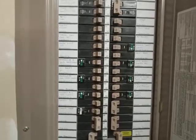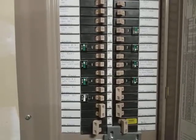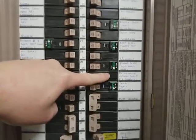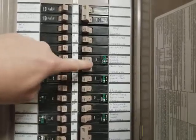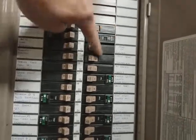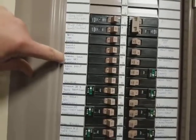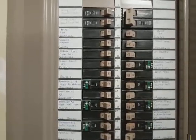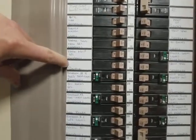Again, you'll have to look down through this, but you'll want the downstairs lights, the bathroom, the downstairs family lights. There's the refrigerator and the GFIs on the kitchen, dining room, front foyer, microwave, nook pantry, master smoke lights, crawl space, heater furnace, which we mentioned, garage, kitchen lights, garage door open, GFCI. Obviously, when you shut the garage without power, you'll have to pull the emergency switch and shut it, and then you can re-engage it once you get power back to it.